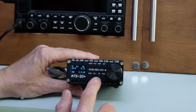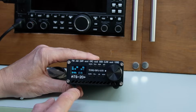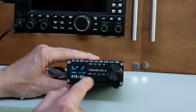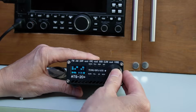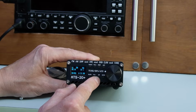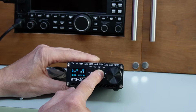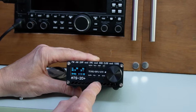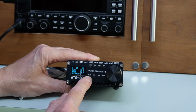A good thing is the fact you've got all of these little tiny switch controls here on the front. Saves you going into the menu. Easy press there, up and down for the bands, through long wave, and then onto the short wave bands. The volume control is an up and down press. It would have been nicer maybe if you could have pressed the VFO and that would change to the volume. Bandwidth filtering, again on the button there, that's good. Step rate on the button, and then the AGC control, which you'll probably want to turn off when you use upper and lower sideband, and then the mode switch, which again will select AM, upper, lower sideband, things like that. So very useful that you've got those on the front of the radio.